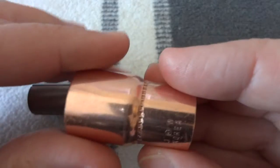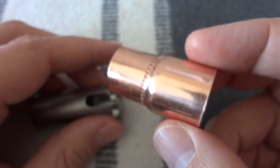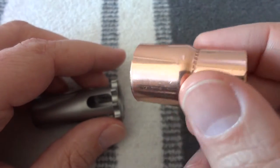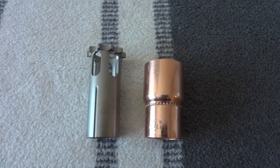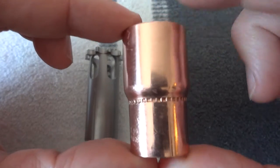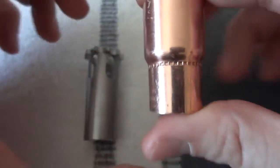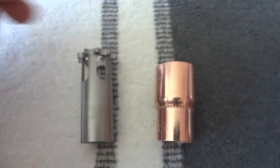It's copper, so it's going to corrode, but not really that bad — and I can just go out and get another one for two bucks. I'll throw it in with my other suppressor parts once they get out of jail and it should work just fine. All I'm doing now is waiting for a call on what length it has to be. If I had the suppressor I could measure and make it just a little bit longer. You don't want to thread it all the way down — you want this to fill up the space completely, but you don't want any gap, because then the piston will still be moving around and it's going to batter up the inside of your suppressor.